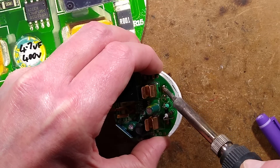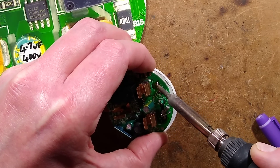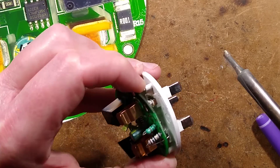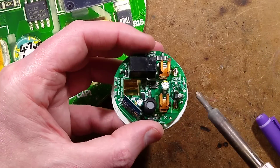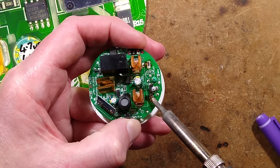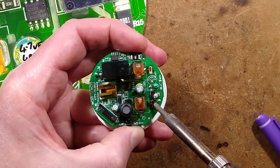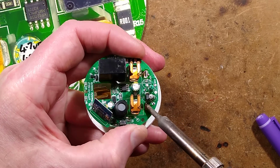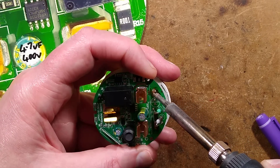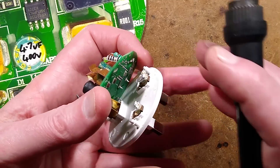It's moved a little bit, so I shall go back to this one and heat it again. This is where everybody will be saying you should use a higher mass soldering iron, a better one than that cheap Chinese one you're using — to be fair, yes, I probably should. So let's reheat this solder connection. This is what it's like in real life. I'll just reheat this plated through-hole and wiggle it a bit — and it has come off.